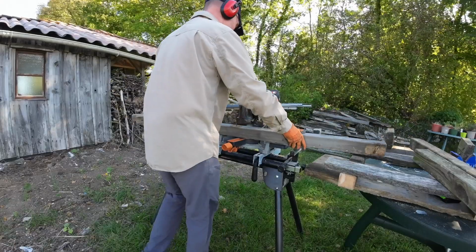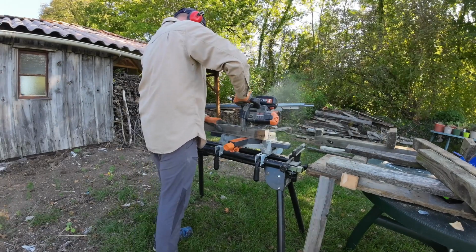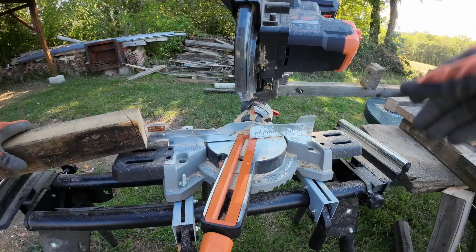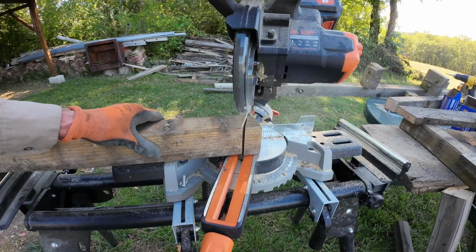The next thing I needed was 3 uprights to support some kind of roof. So I turned again to the remaining parts of the 3x3 timber. On top of these posts I cut a 22.5 degree cut.